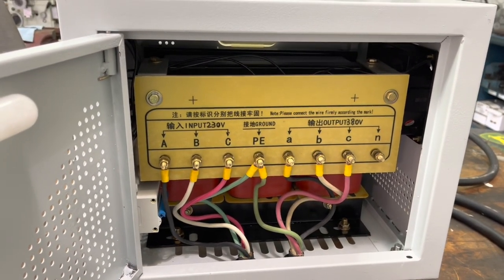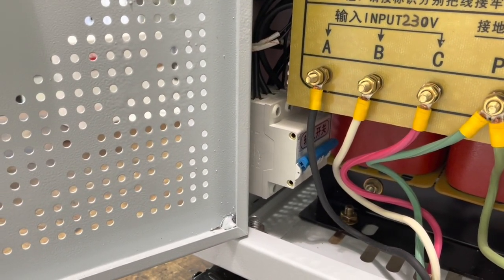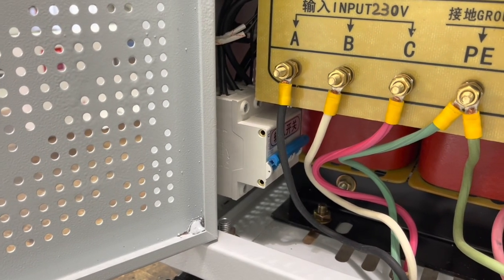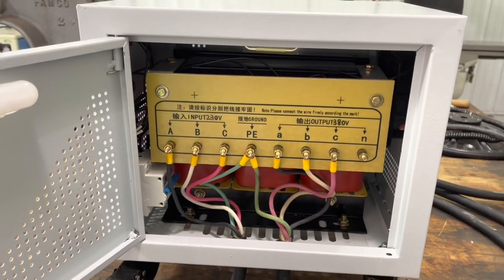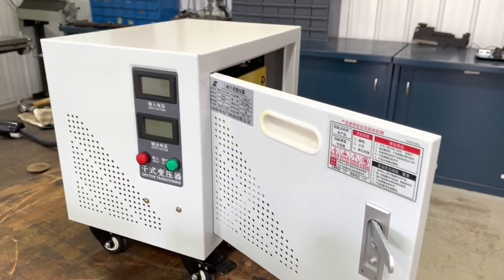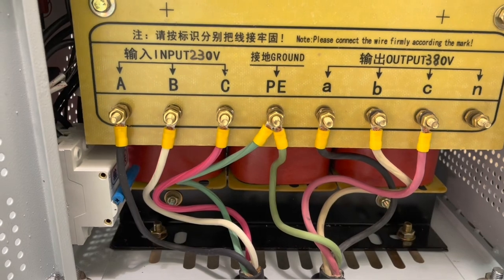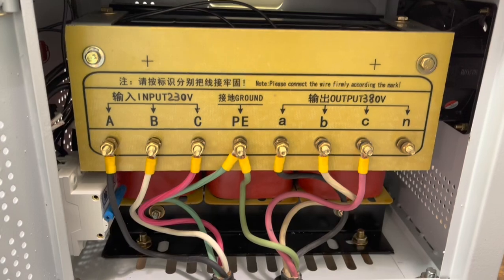Pretty simple. There's a circuit breaker in here that gave me a little bit of trouble — it was tripped when I hooked everything up. I couldn't figure out why this wasn't working, then realized it was tripped and just reset it. It's got a little fan in there that keeps it cool. It's a pretty good little unit — surprisingly clean voltage that comes out of it. Put an oscilloscope on it and it's pretty impressive. Whatever company makes it is doing a pretty decent job.